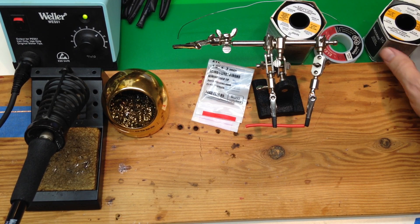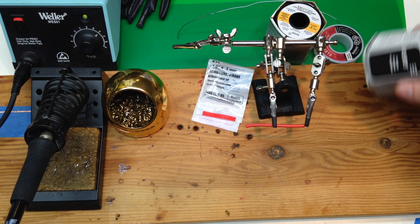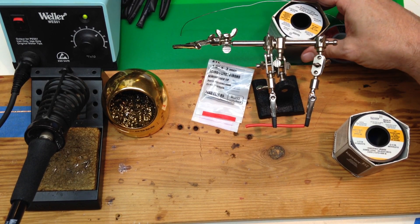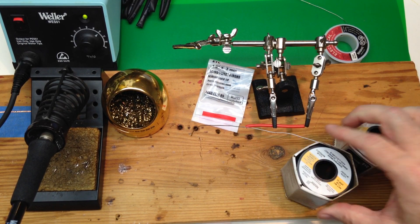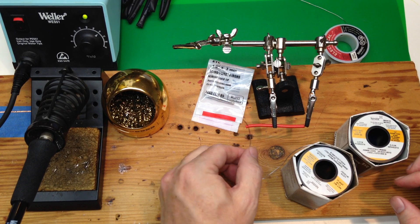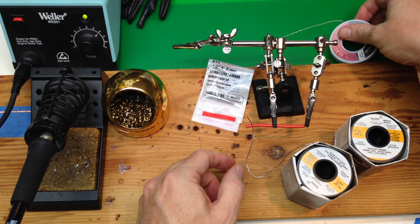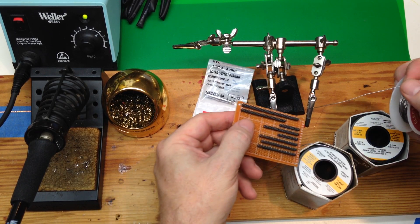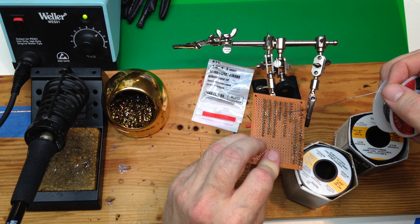You should be using electronic solder. Don't use plumbing solder because plumbing solder has acid flux — good for pipes, bad for electronics. You don't want to cover your electronics with acid and have your projects eaten away. Get a good name brand one. I've got it here in two sizes: .8 mm, good for bigger wires, and .5 mm, which is nice when you need to get into some smaller areas.